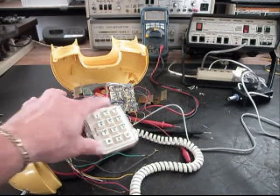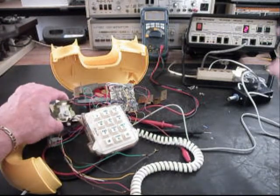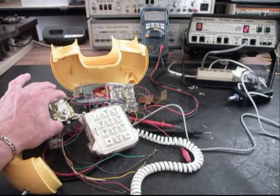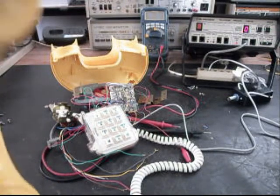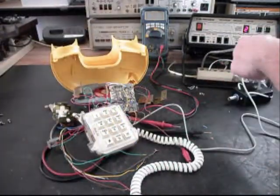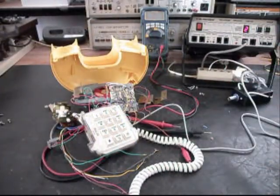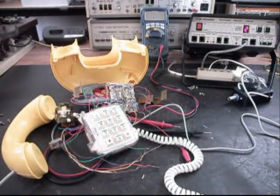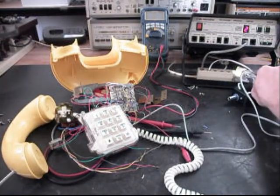I'm going to end in a 2, then I'm going to hang up. You'll see the analyzer, and then I'm going to seize the analyzer and give you some dial tone again. I'm going to dial with 2 and transmit into the handset. If you watch that red light on the analyzer, every time you see that red light that's an indication of 100% modulation on transmit. 1, 2, 3, 4, 5, 6. Hello, hello. We're in the process of putting everything back together again — I want to unplug the telephone.